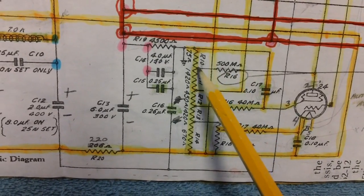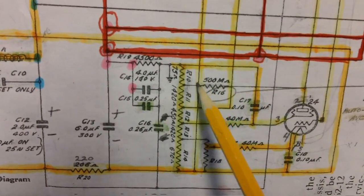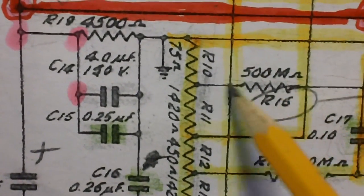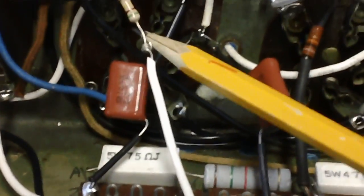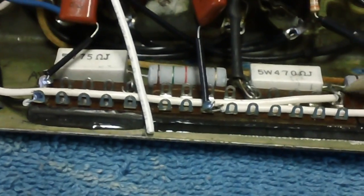For instance, this 500K resistor has to be connected here. It came down to here — it's yellow — but we never connected through the 500K resistor to between the 75-ohm and the R11, which is a 1420-ohm resistor. That resistor has been dangling out there all this time. I'm going to add a wire to it, put some heat shrink around it, and run it down and connect it right there between the 75-ohm resistor and the 1420.